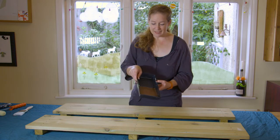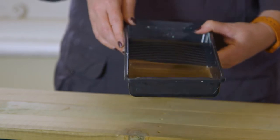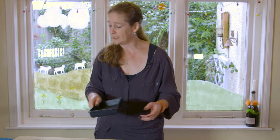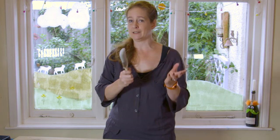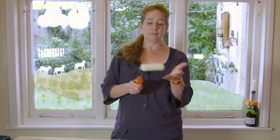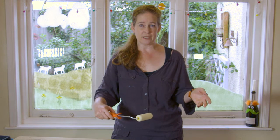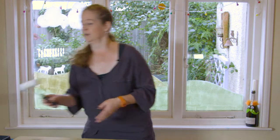You can see the consistency is fairly thick, but with the translucent you can apply it with a sprayer ready to use — you don't have to dilute it down, but you can if you like. Or you can use a brush — good quality synthetic as always — or with a roller. With a roller, you can use a foam sleeve, but foam sleeves can quite often leave a bit of a speckled finish on the coating.